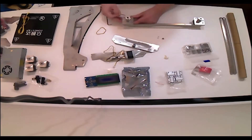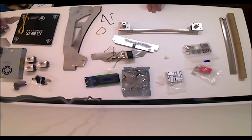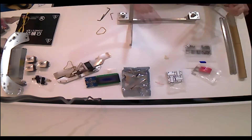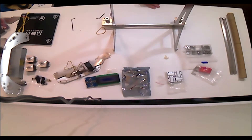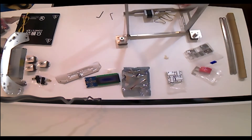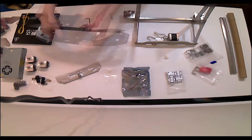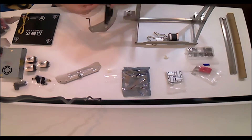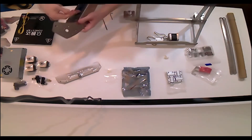The SD card comes with a video explaining how to set up Cura or Repetier Host to slice specifically for the printer. I did attempt to print one of the sample gcode files, but the first layer was way too far from the bed even with the nozzle less than a paper's width away from the bed, so it failed two minutes in and I haven't tried again.